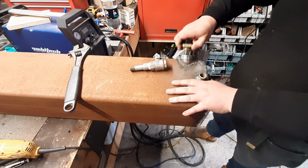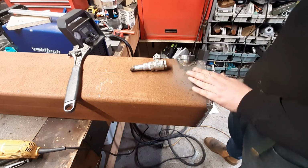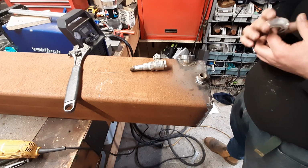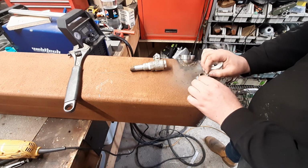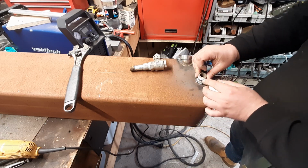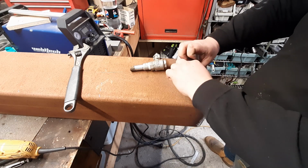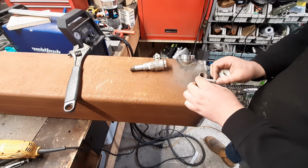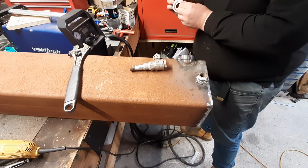So what we're going to do now is actually check it for water tightness. I'm going to screw the drain valve on the bottom. A bit of Teflon tape. And no, this fitting is not new, and neither is the ball valve, because this is just stuff I had lying around that came probably off of an old compressor setup that I rejigged at another work sometime. You know, you just have parts lying around, you might as well use it.